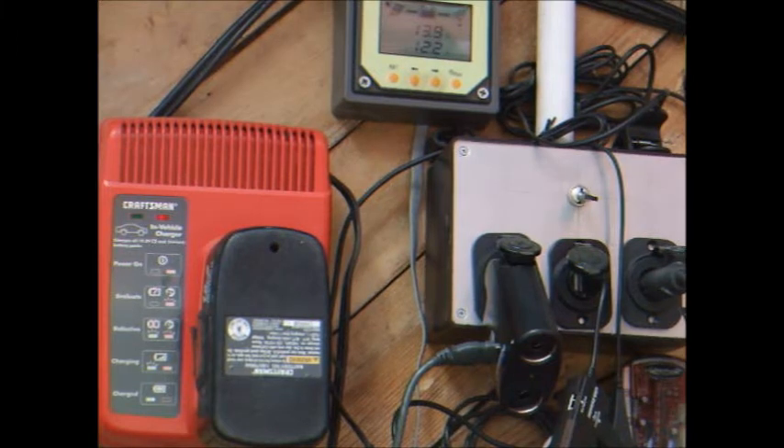Then it jumps up to about 5 amps charging. That's a NiCad battery — the lithiums do about 8 amps when they're charging. I think it's a 60 or 90 minute charger, and when the flashing green light goes off the battery's charged. It's all off of solar power, and I think it's quite efficient compared to running the 120-volt charger and having your inverter running.